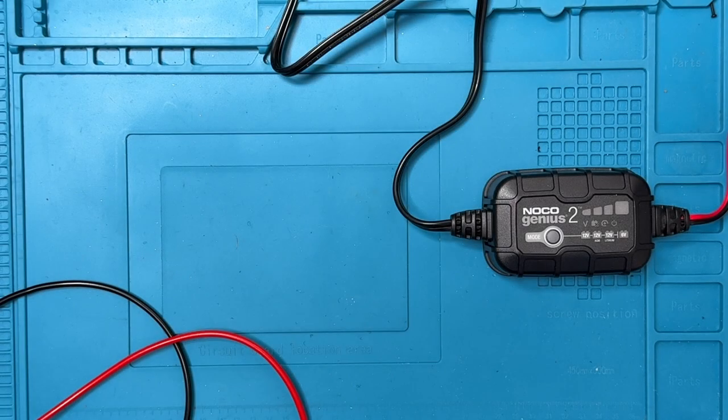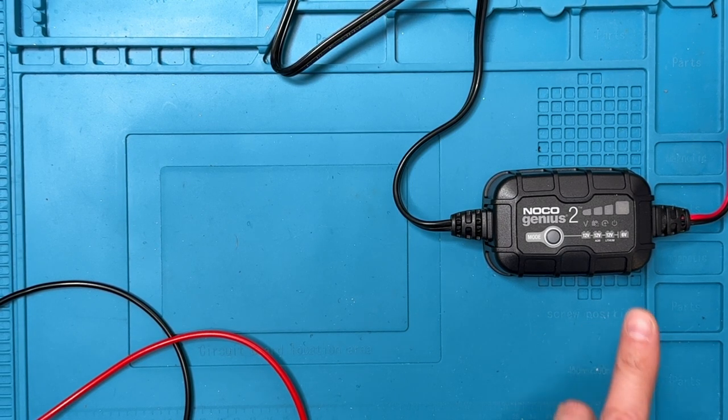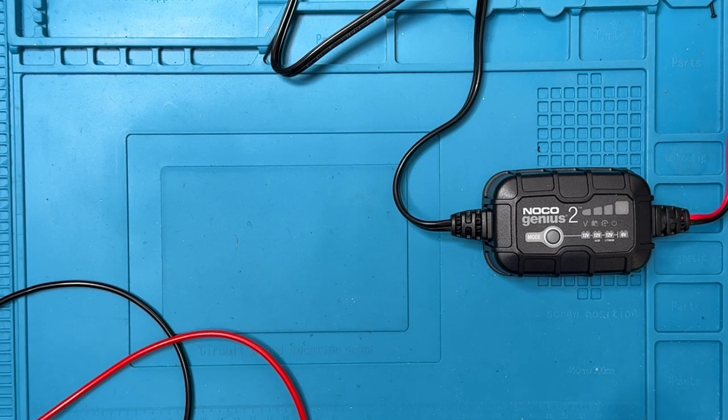In summary, this is a top-notch charger. The charge voltage is very well controlled. The higher charge voltage above 14.7 volts is only applied during the final 200 milliamp charge phase — this is a more gentle approach to charging the sluggish lead-acid chemistry. It takes longer to finalize the charge, but will ultimately deliver a longer overall battery life. If you found this video to be helpful, please give it a thumbs up and subscribe to the channel. Thanks for watching, and until next time!